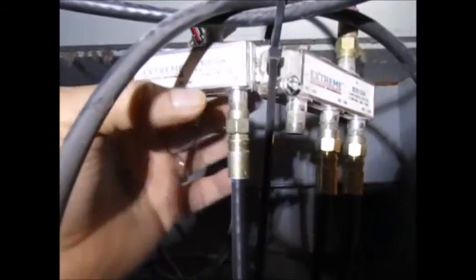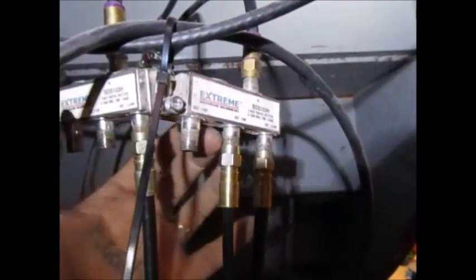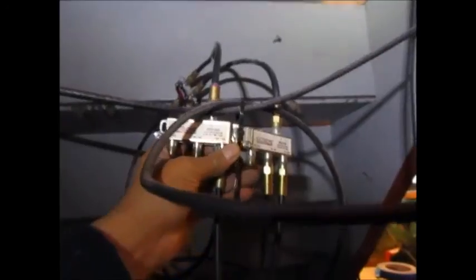I'm going to send into this three-way splitter right here. The antenna from the front room is going to come into this one, then split to my bedroom and the back bedroom. This one right here is going to jump into this splitter and give me access to three more. The two-way from outside I'm not going to touch — I'll leave that for the cable. One of these cables goes to the cable box and the other I'll leave into my bedroom TV to see what happens.